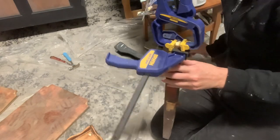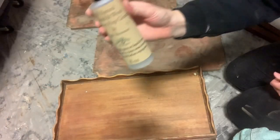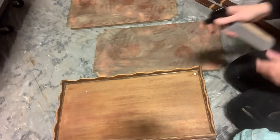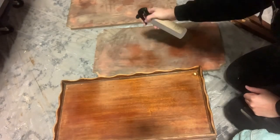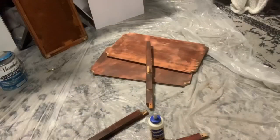Here I'm just using a bit of glue to fill in the nail hole. I'm using my Chalk Mountain Furniture Cleaner to give the whole thing a clean. I'm going to be priming this piece so I'm not terribly worried about making everything perfect — I just wanted to make sure it was really smooth and I got off any finish that was not good anymore, since it would mess up my paint job. I got off anything that was flaking or a little too crusty.